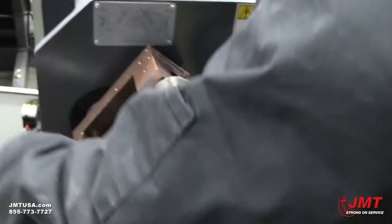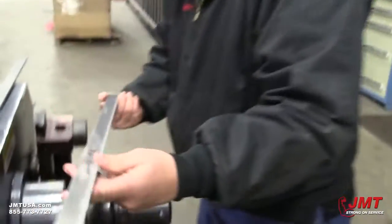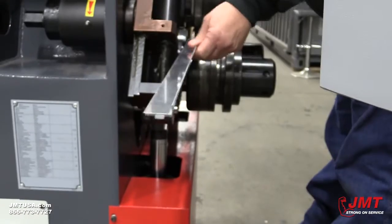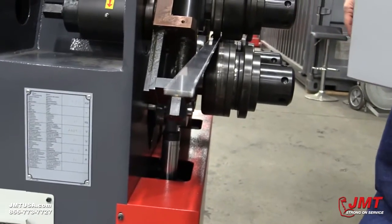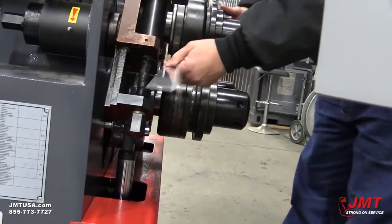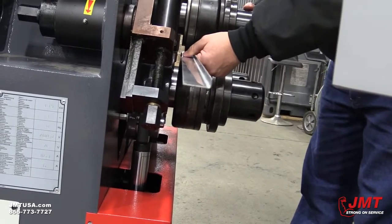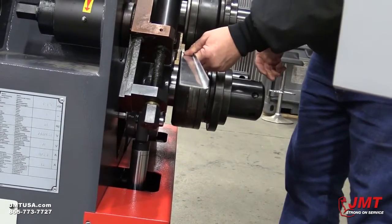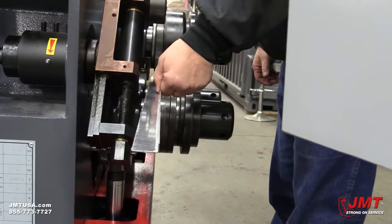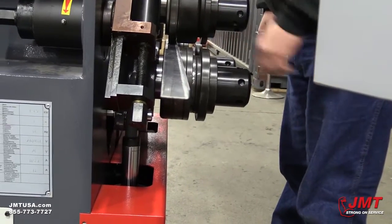When I feed my piece in, I'm going to feed it in with the leg up, and that leg is going to fit right inside of this groove right here. I'm going to turn this machine on and roll this side down a little bit, slide that in there, and see how much play I have. I want to tighten that up until my play is just barely minute — just barely can wiggle in there. I need to keep this top roll tight to support this rib or leg on this angle so that it won't ripple or bend funny.